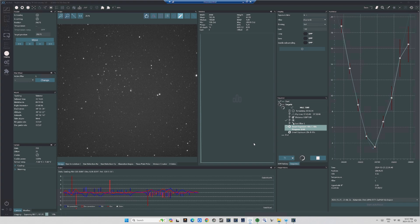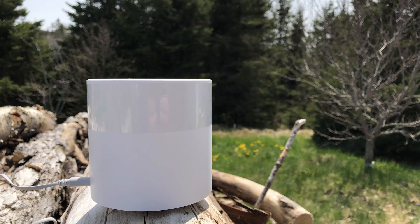So I switched the router's operating frequency and immediately saw a huge difference in performance. Even in heavy fog, I now get four bars of signal as much as 50 meters past the observatory. So if you've been fretting over how to control your astrophotography rig at range, or struggling with a weak Wi-Fi signal, a set of Wi-Fi expanders with directional capability will improve your signal quality. And switching from 5 GHz to 2.4 GHz will give you much greater range, as long as you don't live in an area with a great deal of competing signals causing interference.